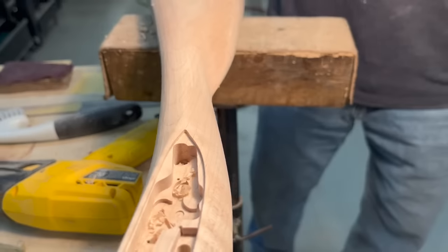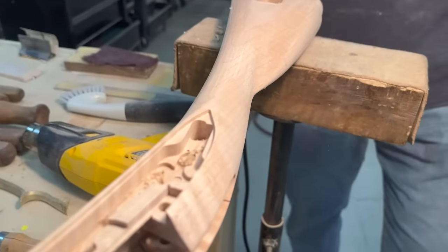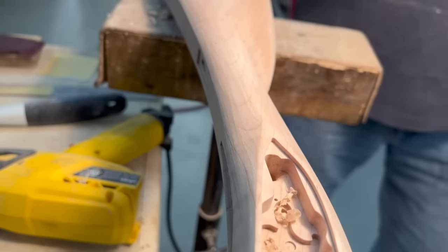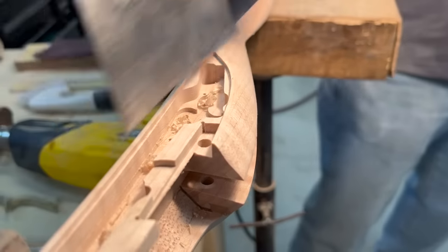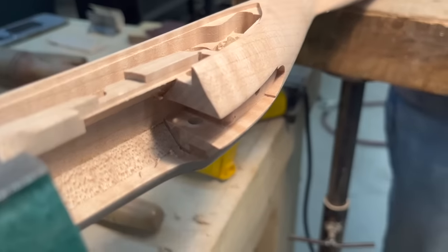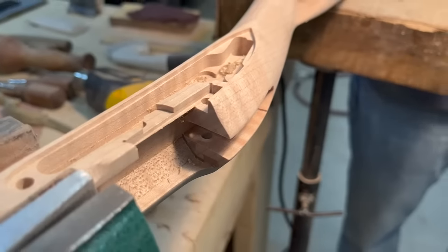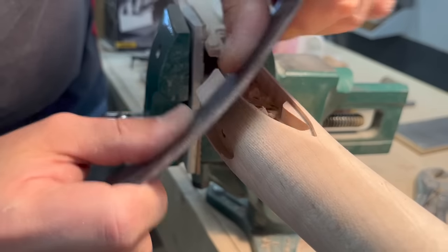It takes a little more skill to leave it coarse and look good, to be honest, because you can go over it lightly and get everything just right. But to have these nice coarse facets look good takes a little more work. So you have to respect the grain direction, like I mentioned. Now, if I want to do the top of the wrist, this would be bucking the grain if I go from here to here, because generally the grain comes somewhat out the top of the wrist, depending on the orientation of the stock. It would be rare to have the grain otherwise. So in this case, I'd start up here and run down the wrist. You can see some of our machining marks there. And those should just scrape out very nice.